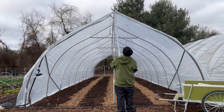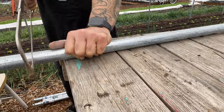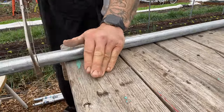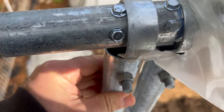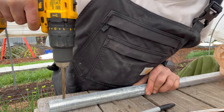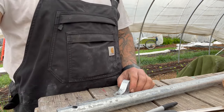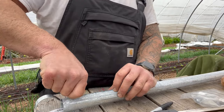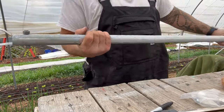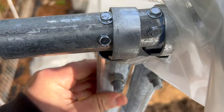The first step is to get four pieces of chain link fencing top rail, measure the tallest point of your tunnel, and cut them accordingly. I bought 10.5-foot pieces and cut them to 9 feet, making sure to cut off the swedged end. I then took the 18-inch piece I cut off, climbed up the ladder, and installed it into the piece of top rail used as the center purlin, securing it with a self-tapping screw. Then I drilled a hole in the 9-foot top rail piece and inserted what's called a tension band from the fencing aisle at Home Depot, held together with a carriage bolt. Now my top rail has a loop so it can hang from the piece inserted into the end of the center purlin.